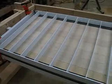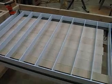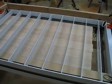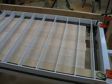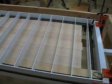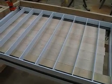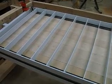It is intended to glue edge to edge 3/4 inch pieces of wood, and the top section is resting not only on the 3/4 inch thick pieces of wood in the panel, but also on the 3/4 inch thick steel bars. And the top section will never go below the top surface of the steel bars, and there will always be 3/4 of an inch between the bottom of the cross walls that you see in the top section and the top of the cross walls that are directly underneath the wood panel.